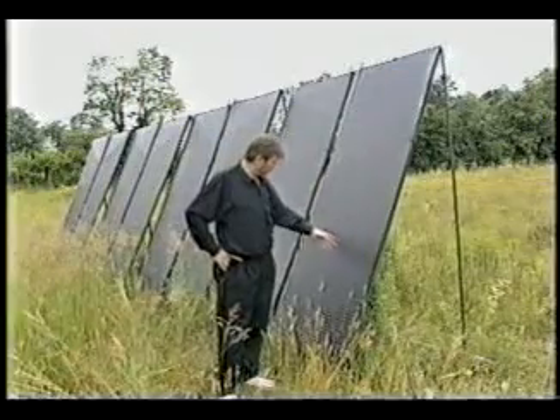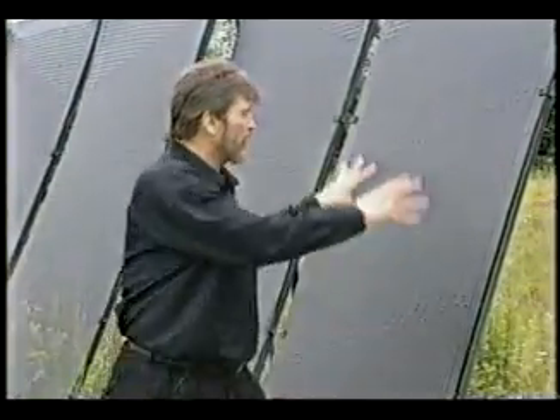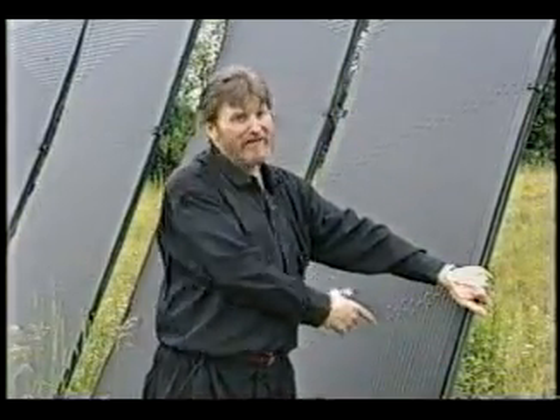They're eight feet high, three feet wide. The refrigerant we put in here boils at 40 degrees below zero. Therefore, any time, day or night — outside in a rainstorm, windstorm, hailstorm, snowstorm, or on a nice sunny day or in the middle of a cold night — as long as the refrigerant inside this panel is colder than whatever the air is outside or the phenomenon hitting this panel, then the heat from the air, the sun, the wind, or the rain or snow will be transferred into the refrigerant on the other side, because of the second law of thermodynamics: hot goes to cold. So if this is the coldest thing outside, anything that touches it is going to give its heat to it. A little bit of heat goes a long way.